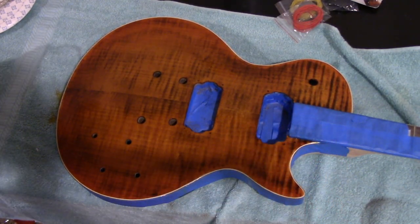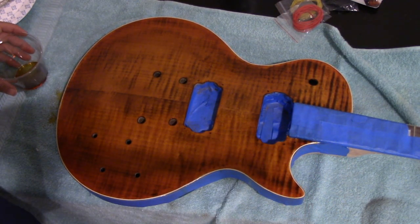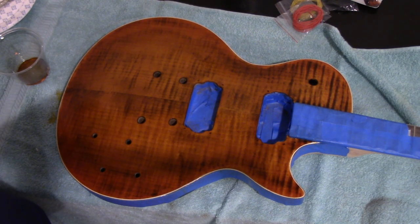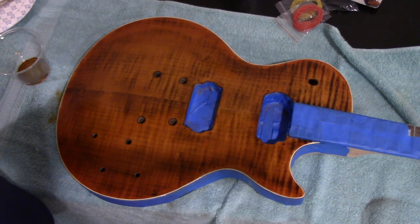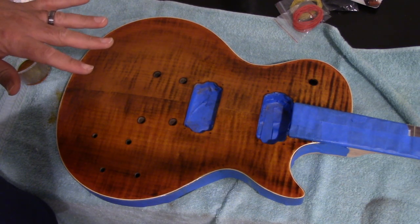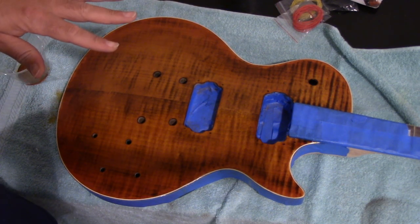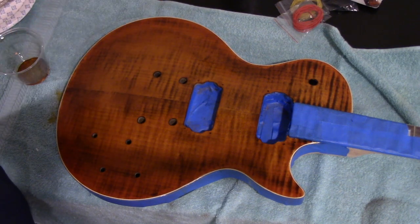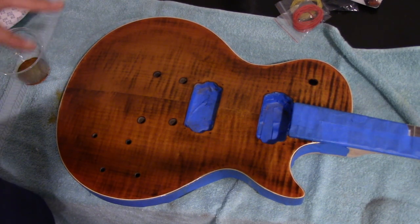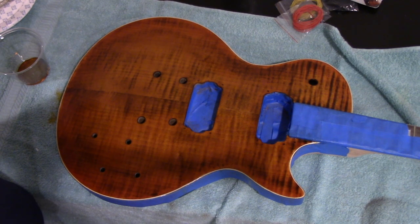As I said, this is probably going to take a day or two to completely set and cure enough so I can sand it, and I just keep doing this process. The next step will be sanding with 0000 steel wool and then applying again. This is the sixth layer, and I've heard anything from 8 to 14 layers recommended, so I really want a nice somewhat thick protective coating.